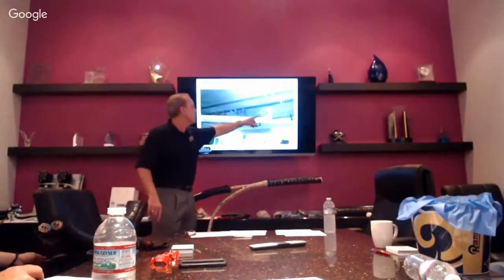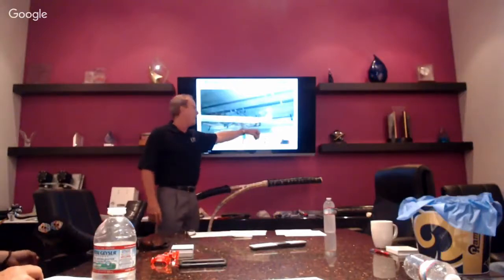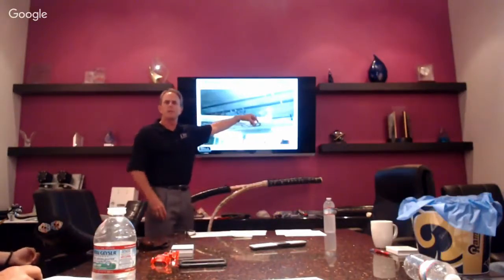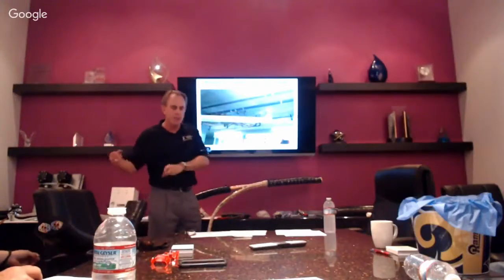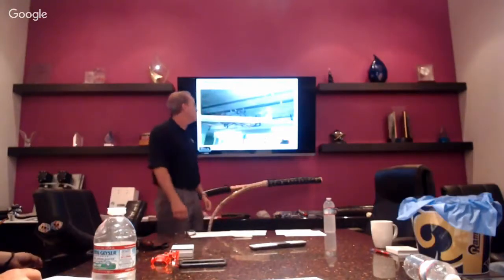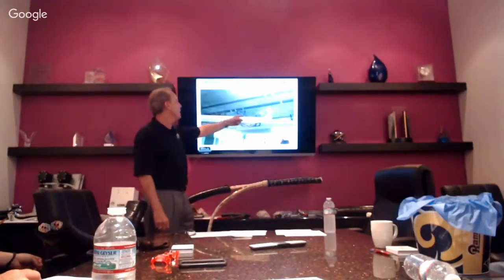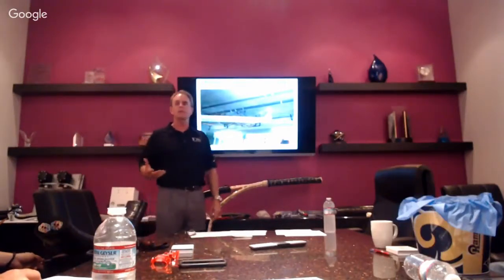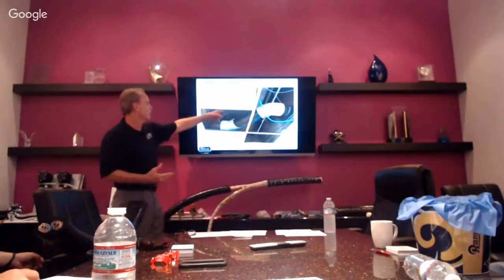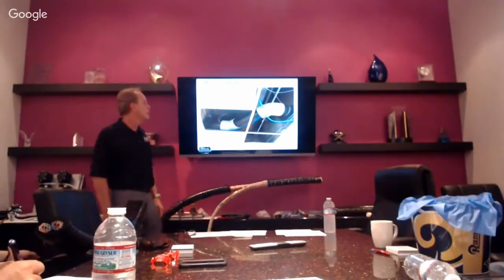Again, plumber pipes, that's a real short radius. That's not a 24-inch sweep. That's not going to work. They won't go. They just don't go. And we've had GCs say, well, I need you guys to help pull. It's like, yeah, we can pull. We can just pull a bunch of remnant when we get it out. We get some conduit, a couple of line sets, everything's ripped up, cracked, bent. We just can't make that turn. So when you see plumber turns, or we got the 45s, gotta love those, they don't work. We can't get them through.